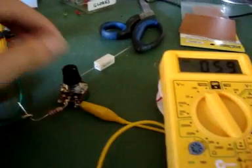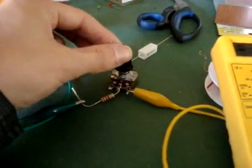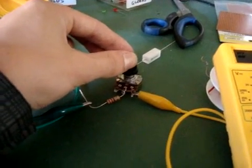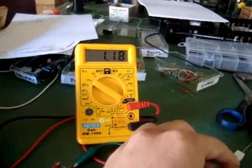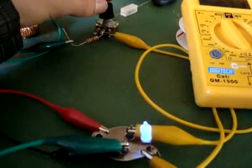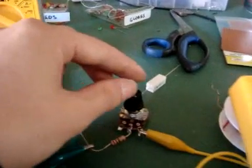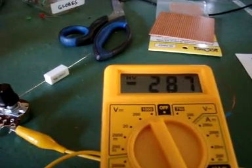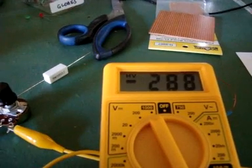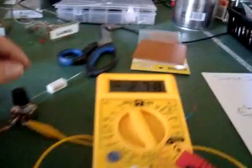So at the moment I've got it set to one of the highest resistance values, and you'll see it'll be drawing a bit over an amp. The frequency goes lower as we apply more resistance. Now I'm just measuring the voltage across the emitter and collector, and you'll notice it's sitting at minus 290 volts, pulling 1.1 amps.